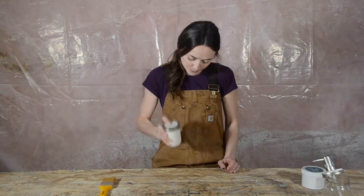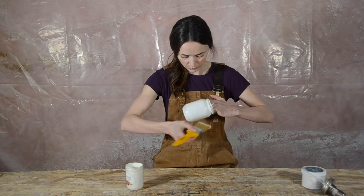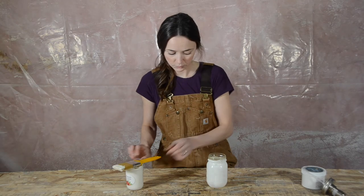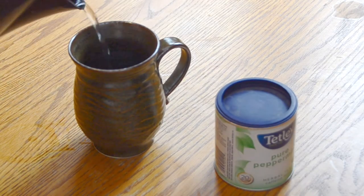There's a ton of flexibility in the application of paint at this point. You can use premixed chalk paint, regular paint, or spray paint, but I recommend chalk paint if you'd like to distress yours. If you use chalk paint, make sure it's completely dry before doing your second or third coat, or the brush may peel off the previous coat.